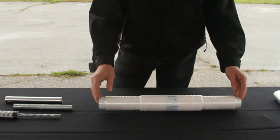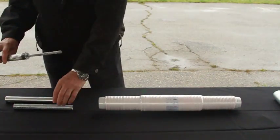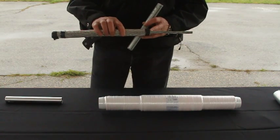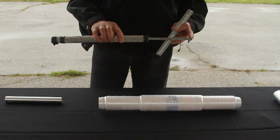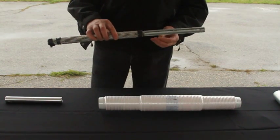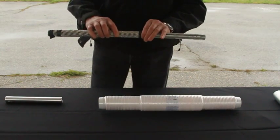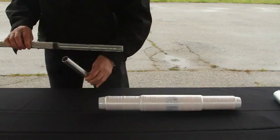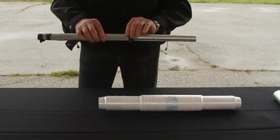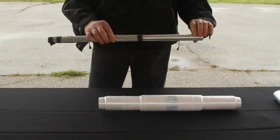The preparation of this explosive sleeve is quite similar to compression, insofar that we require to cut the conductor and expose the steel cord long enough to be able to insert the steel sleeve. If the diameter between the steel sleeve and the conductor is a little different, we provide a filler tube which brings everything to the same diameter, because when we're going to compress this, we want the surface of the sleeve to be uniform and equal.